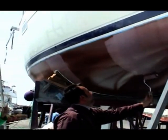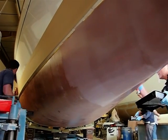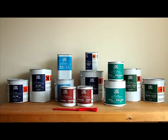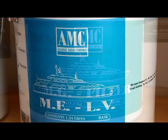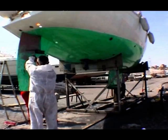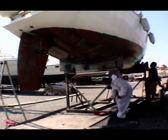You've just seen the application of Coppercoat to a cleaned and abraded fibreglass hull. However, for those requiring a greater level of protection against osmosis, Coppercoat can also be supplied with AMC's own range of matching epoxy resins. By applying additional resin before the Coppercoat, a thick and highly impermeable barrier can be created. Furthermore, Coppercoat can be applied over most proprietary brands of marine epoxy primers and anti-osmosis systems — please do check compatibility with AMC or your local Coppercoat distributor.